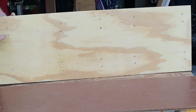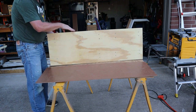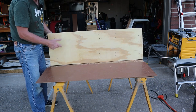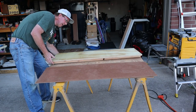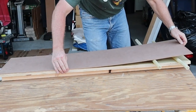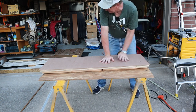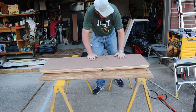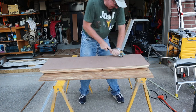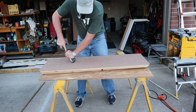I almost screwed up — I wanted the screws in before I put the hardboard on top of it so it would hide them. I didn't want them coming in from the bottom because I felt coming through the top they'd have a better bite. So I hurried up and put them in while it was still tacking up and kind of avoided that screw-up. I've got a J roller here, and they're right — once it's down you ain't moving it, because I just tried to move it and it didn't move. Once you put it down, it's done.